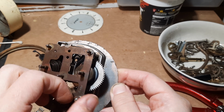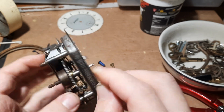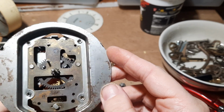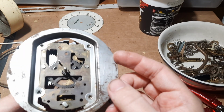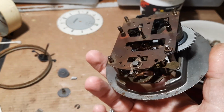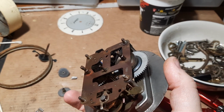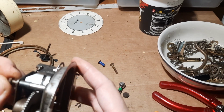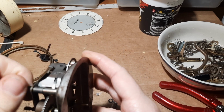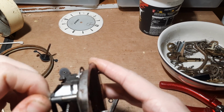But yeah, I'm pretty happy with this pillar I replaced. I do not have a rivet gun with me right now. It would help if I did, but I just peened over the end of that shaft again, like they did originally, and yeah, it worked pretty well, because I didn't grind the rivets off the old movements. I ripped them out. Well, it's a hard way of saying it. I don't really rip them out like to bend anything else. I do it a bit carefully, but essentially it is ripping them out, because you're just bending material away as you do it, rather than actually cutting into anything, and that allows you to peen the metal over, because there's still some meat left on the bone. I'll tighten these up now.